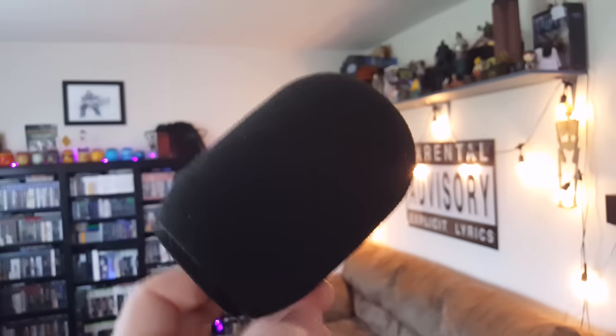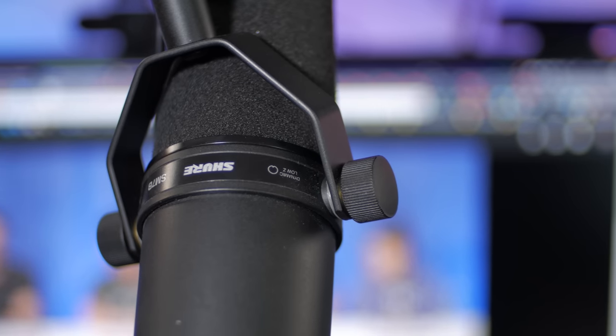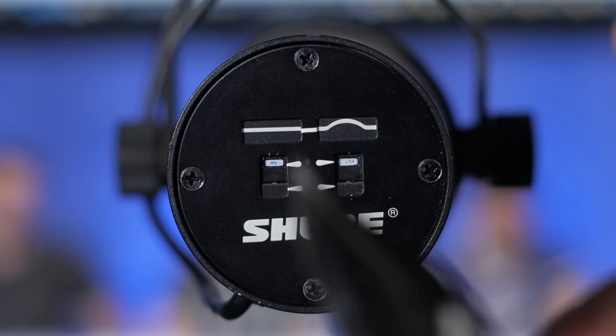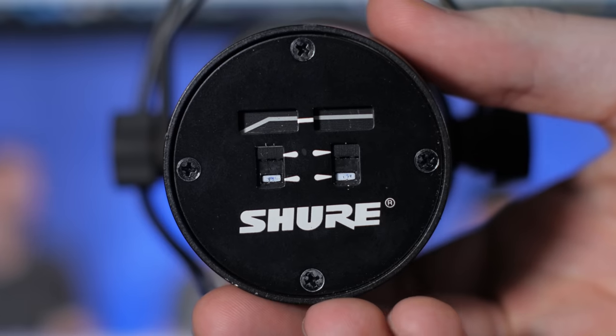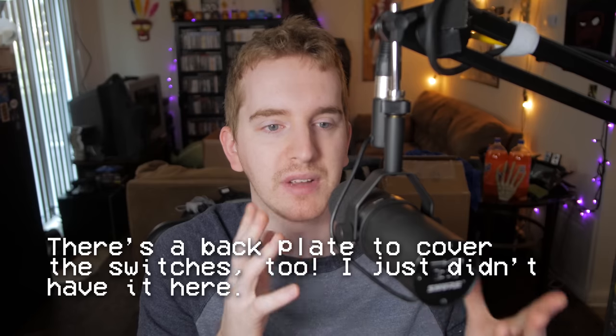The XLR cable seems to bend at exactly the same point as the actual adjustment screws that screw into the side of the mic, which makes me a little uncomfortable as that cable would be hard to replace or fix — but it also seems intentional. Just don't yank on it too hard. The back of the capsule has two switches: a bass roll-off switch that starts around the 300Hz range, and a presence boost switch which opens up the 1-10kHz range. These switches can be adjusted by a small flathead screwdriver or the tip of a pin — you can't really do it with your fingers, which prevents them from being hit on accident.